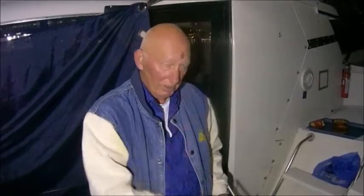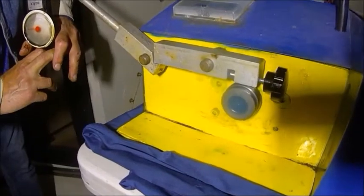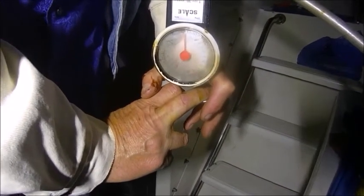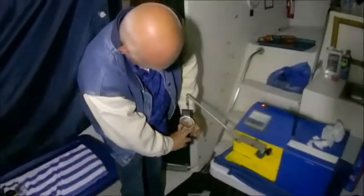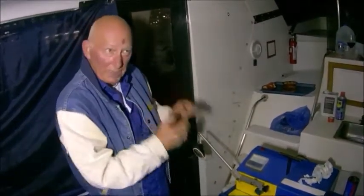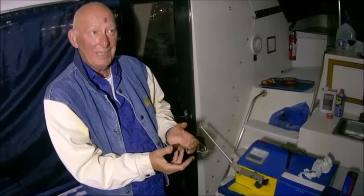If you have a machine operator who doesn't grease their machine every day like they should, this is what's going to happen with our grease. That's where it seized before. This without grease. That's still about the same amount of friction reduction. Now, the reason it actually went further than the last time, if your bearing happens to heat up, it makes this work even better.